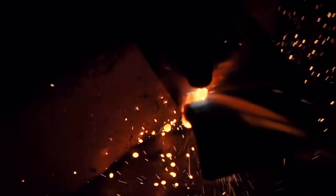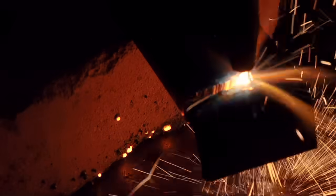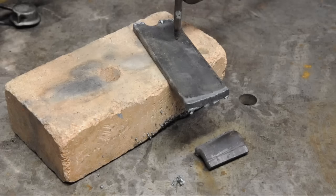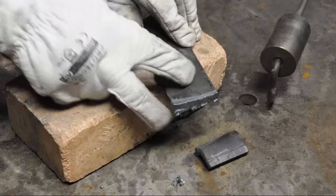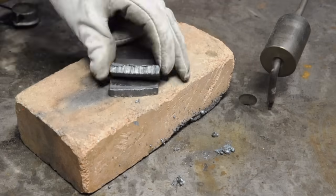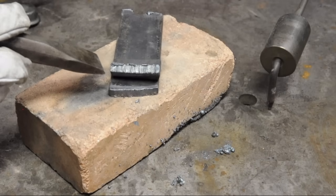When I see a small puddle has started to form, I can hit the lever and start cutting. Here's a little interesting tidbit — once that steel starts cutting, once it starts to melt, you technically don't need the acetylene anymore.